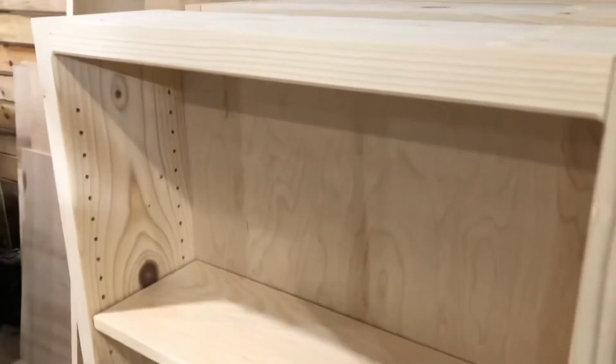Yeah, so here's all the shelves. I didn't show you, but I just got done rounding over all the edges. Used a 1/8 inch router bit. I'm going to sand them. I'm not going to bother boring you with that. You can hang around if you want, but you don't want to watch me sand all that. So next, I will put them into a shelf just to kind of give you an idea what a finished product looked like unfinished. That is all.